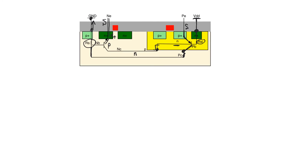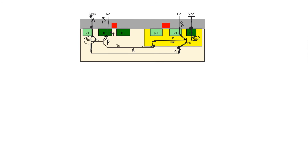So we have two bipolar transistors that were created accidentally — we don't want them to exist. The question is: are these bipolar transistors dangerous? Notice that the two bipolar transistors are enmeshed with each other, not by wires, but fundamentally: the base of the PNP transistor, which is the well, is also the collector of the NPN transistor, and the base of the NPN transistor is the collector of the PNP transistor.